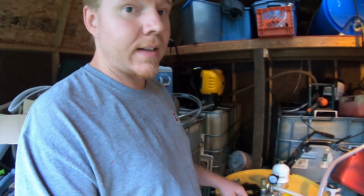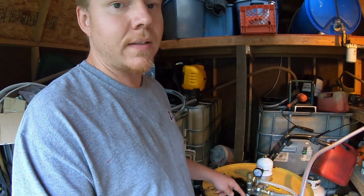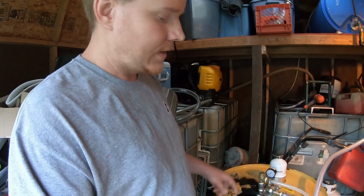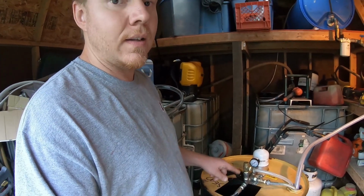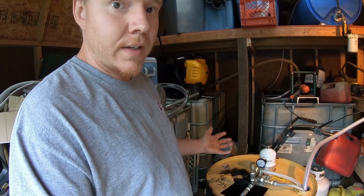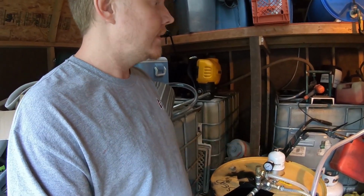and that doesn't take into account the moisture that has already evaporated off during the whole process, because this drum is up to temperature the entire time. So in a 20-hour batch, you're going to be losing a lot of moisture just venting out of the top of the drum that the centrifuge doesn't have to catch, so you won't see that.